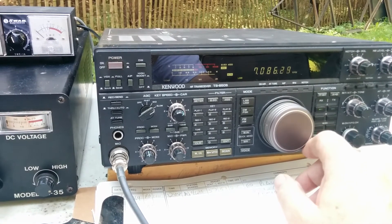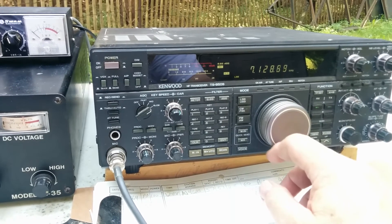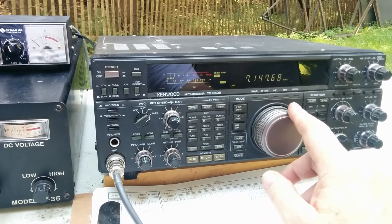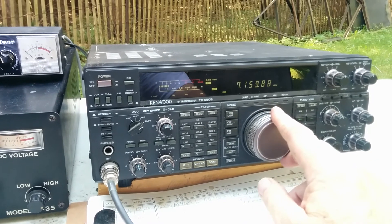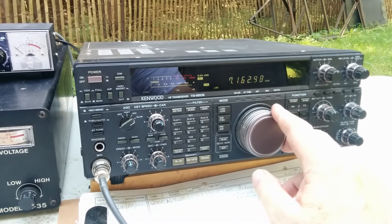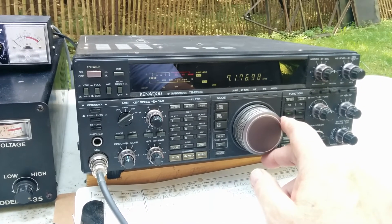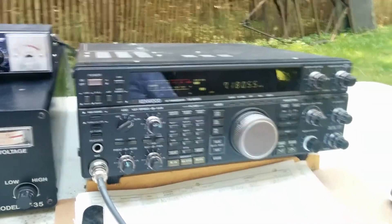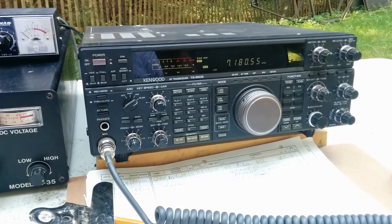Anyway, something thrown together with some spare wire seems to work pretty well. The 80-meter dipole was an existing one - it runs with a 1-to-1 balun, RG8X coax, and 12-gauge insulated wire. The 40-meter dipole uses 18-gauge stranded insulated wire. Both are black so they're pretty hard to see. Anyway, this is Rob, VE3PCP, signing off for now - see you next time.